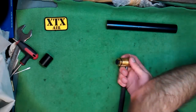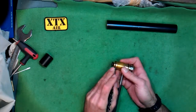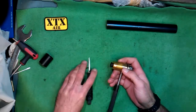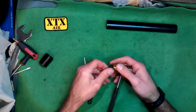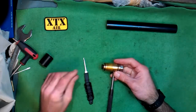The other possibility is the O-ring, which you can use a little pick or something to remove — careful that you don't scratch the actual brass body. Just lift that out, give it a clean, and put a new one back on. You can put a drop of something like Abbey SM50 on the O-rings just to protect them and lubricate them a bit.